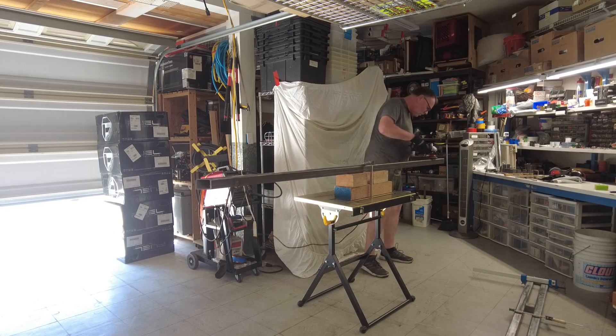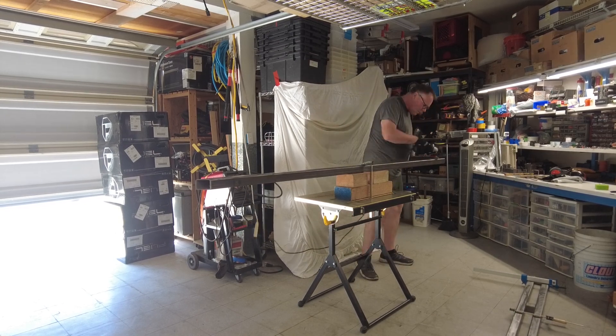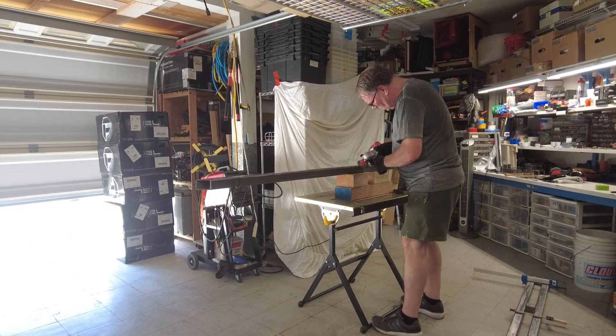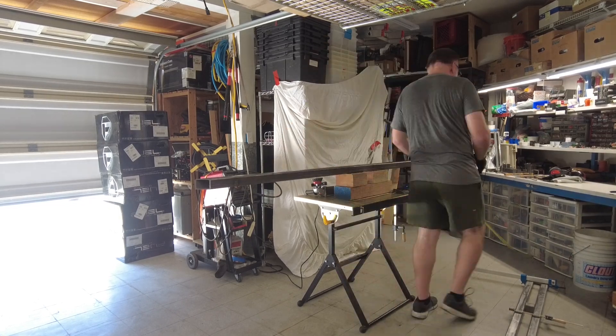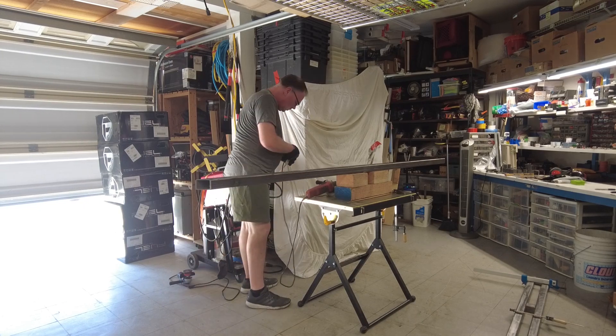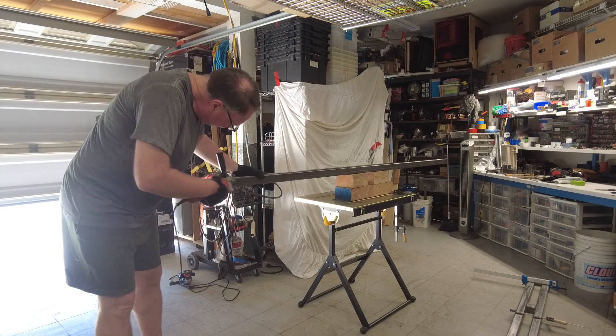The construction of the main slider parts is really pretty simple - it's just the two main bars with five connector pieces in between and then metal caps welded on the ends. We did a 45-degree cut on the front so that it would slide off the rocks a little bit. I kind of wanted to do a little bit more than 45 but the saw really is a limiting factor there.